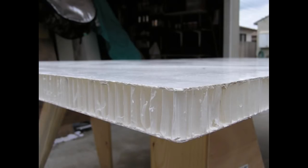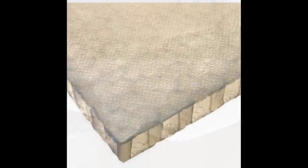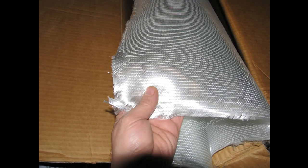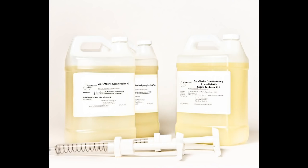I found the structural honeycomb laminated sheet that they were using for around $300 a sheet and went, holy crap, that's expensive. So after some more research, I found the unlaminated version for just under $60. I then located a 50-inch by 100-foot roll of biaxial fiberglass material on eBay for around $350 with shipping. I decided to use epoxy over fiberglass resin because of the odor, longer working time, and strength of the epoxy.